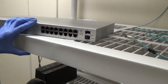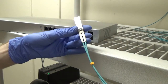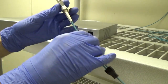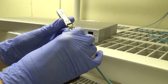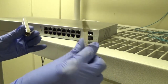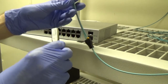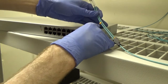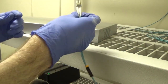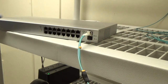Now we've got our switch and we're going to go ahead and connect our fiber. It's plugged into the SFP module already because we were testing and I threw away the little dust caps and didn't want to get the ends dirty. We're going to unplug that before we put the SFP module in. There's our LC connector — just want to make sure not to touch the very end of it because it will make it dirty. Plug that in.